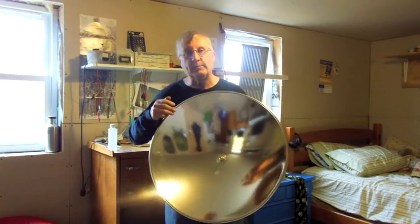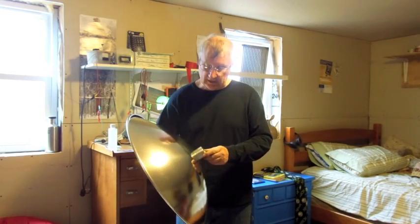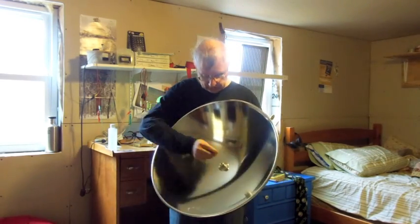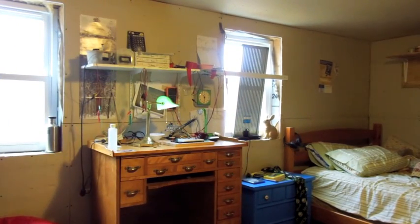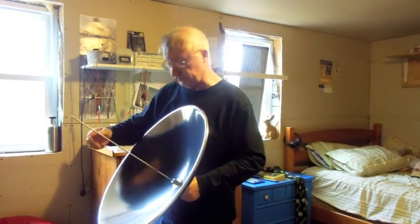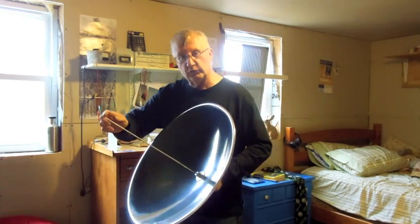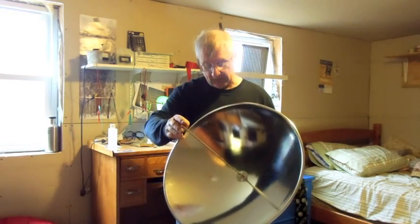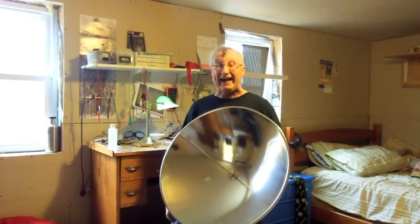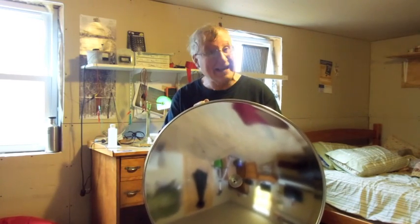What else I was working on was my parabolic ear. I received a reflector yesterday and built the adapter today to capture the rod and for a mounting point for a handle on the back. I'm going to put the rod in it, put a piece of paper on it, and go out on a sunny day while it's still shiny — move the paper up and down until I get the smallest possible dot from the sun, which will tell me the exact focus point. That's where my microphone will go, but first I've got to paint the whole thing flat black so it doesn't cook the microphone if I point it at the sun. And as an added bonus — oh, cool!